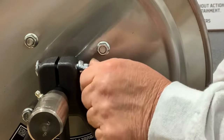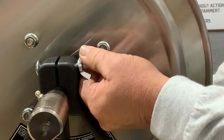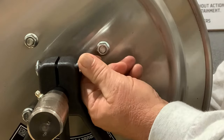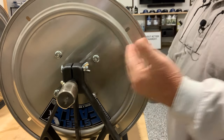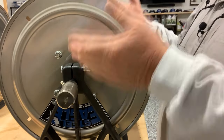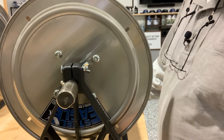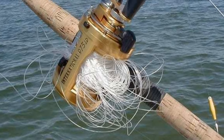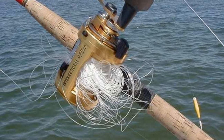The other part you have here is a little butterfly nut that acts as a brake. Adjusting your brakes is very important, especially when reeling out — because if they're really loose and you start reeling the hose out, it'll cause this to free spin and your hose will start coming unraveled faster than you want, creating something similar to a bird's nest on a fishing pole.